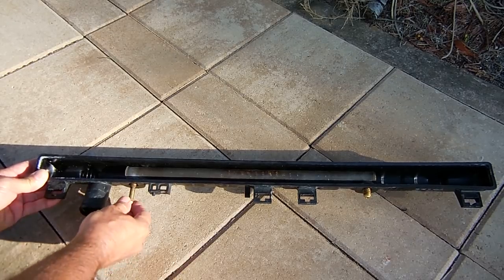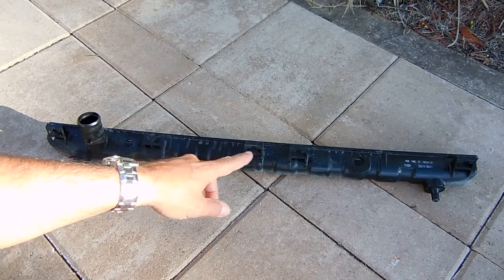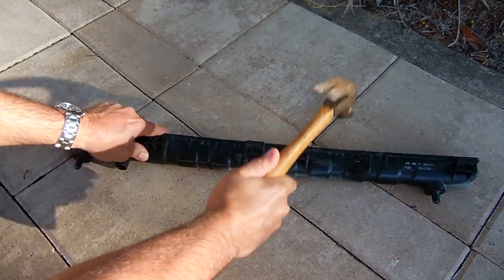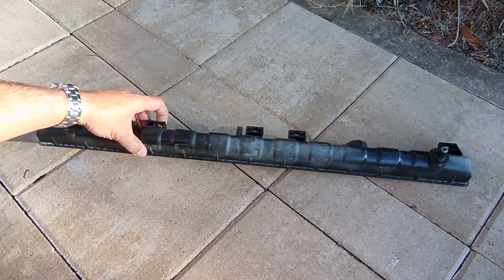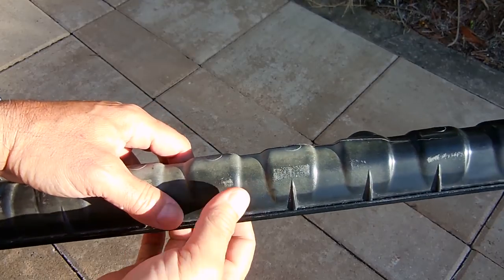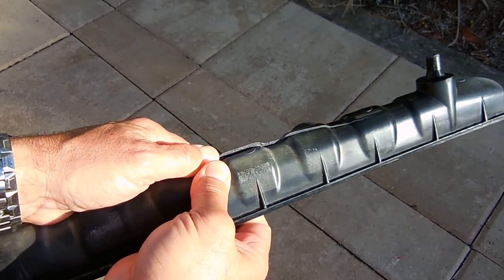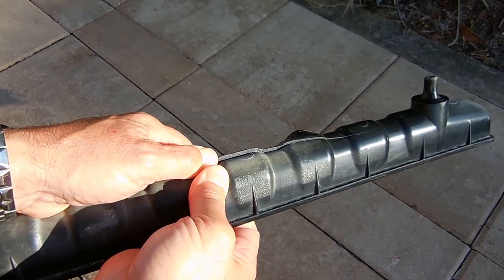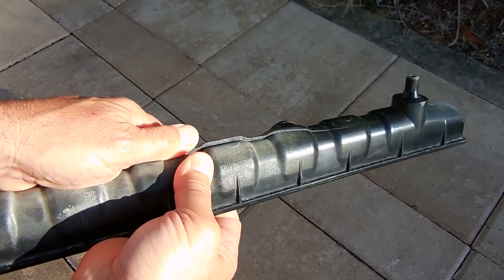Let me pop this out of here — we'll take a closer look. Before I show you the tube up close, I want to show you how strong this housing is. If I take a hammer... pretty strong stuff — it takes a bunch of blows before it would actually break like that. Now if you look right over here where it split after bashing it really hard with the hammer, you can see it has a grainy look to it, like there are fibers embedded inside that plastic. So I'm willing to bet this is probably a fiber-reinforced nylon.